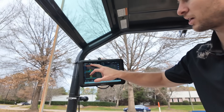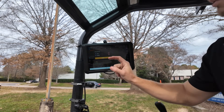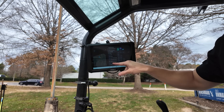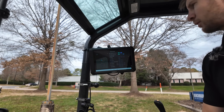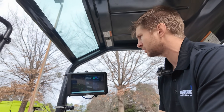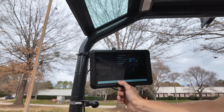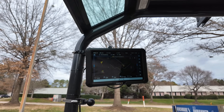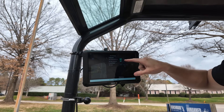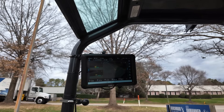If I tap on the upper left-hand corner where it says benchmark shop, that lets me see that I have my line work enabled and my surface labeled. Hitting details, I can choose to do on-field design the same way I would in EasyNav — I can set a flat plane surface, a slope surface, or foundation. Using the eye icon toggles multiple surfaces on, so I can turn them all on or all off. You have a lot of functionality out of the TX73 system to manipulate surfaces and line work. Going back to details, I can turn the surface on and then I've got my cut fill to my surface.